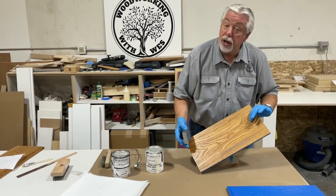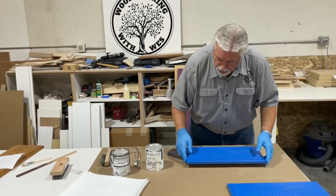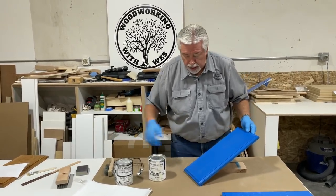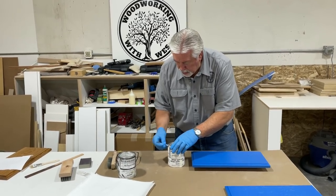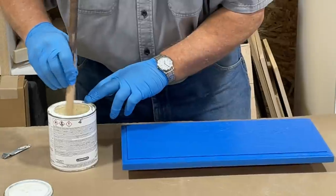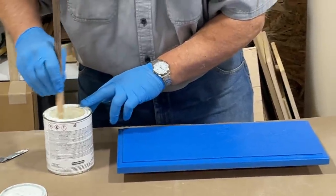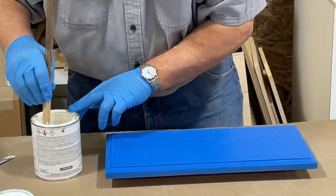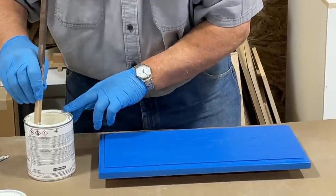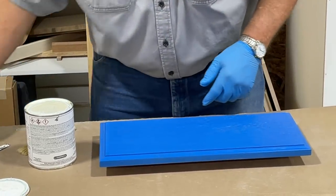Go around the edges. You can see by the back side — we didn't do the back side because this is just a color sample — but you can see the black back side: there's the old golden oak and there's the new color. The sanding sponge is just a fine grit sanding sponge from our retail paint supplier. The first one we're going to do is white, so let's open up our white glaze. Always mix your paints and glazes to get the color to a true color. I'll be applying this glaze with a small brush — I like to put lots of glaze on so it gets into the grain of the wood.